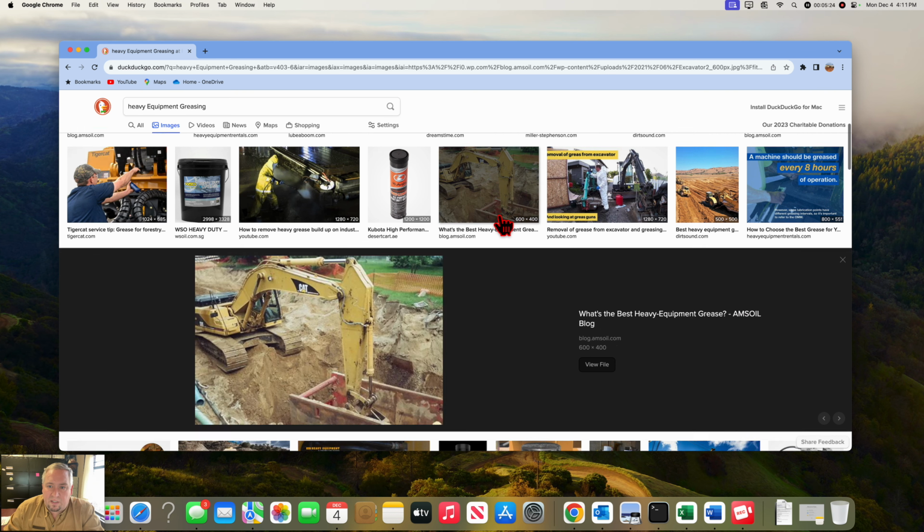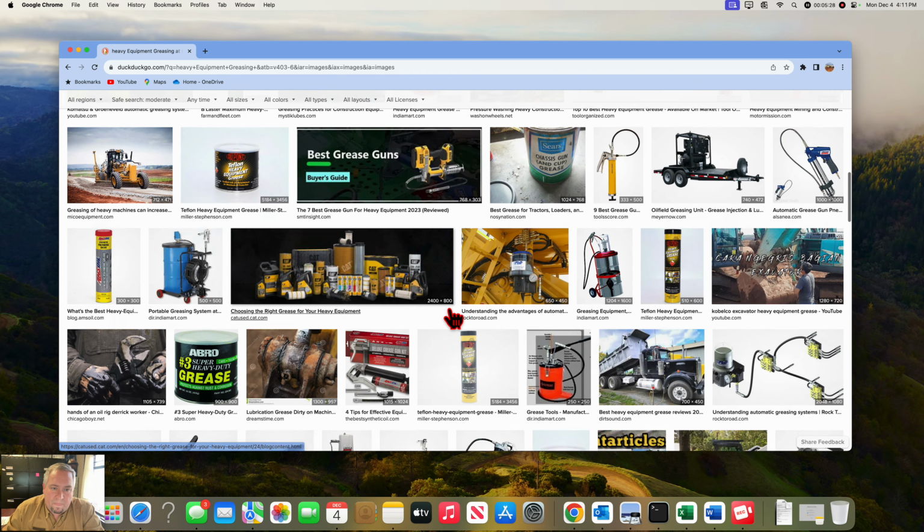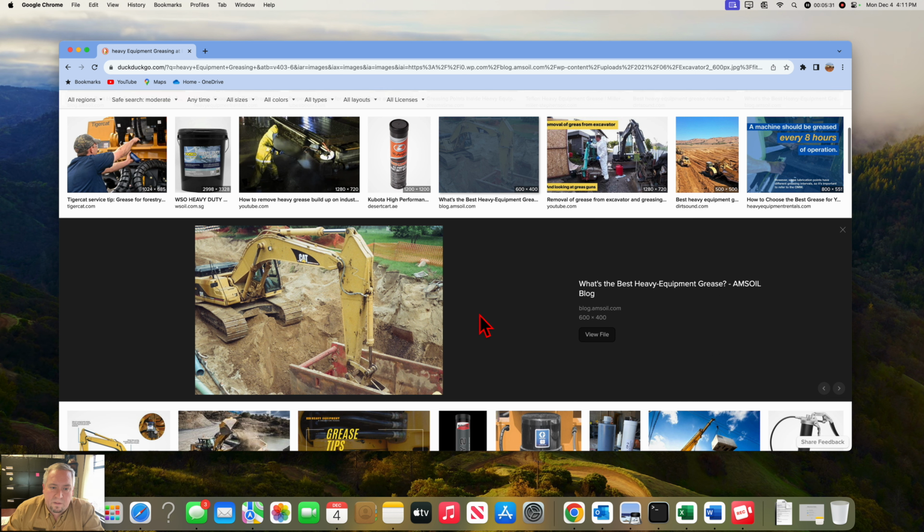If we're going to look at something like this picture here, if I can get it opened up, there we go. If you'll notice, these joints are not down in the dirt so much, so they don't need as much. But this joint gets a lot more pressure than, say, this joint here. When you're clearing and sweeping back and forth, it gets side to side a lot of binds, so you'll get some squeaks. And if you let it go dry, I can promise you it's going to take you 4 or 5 days of greasing to get it back right. So it's going to be hollering at you.